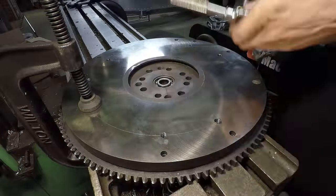All right, so now the work begins. This is a 1.25 inch thick aluminum plate here, 6061. This is what I'm going to be making the adapter plate out of. I wanted to try to find 1 1/8, 1.125, but I wasn't able to find that for a reasonable price, because I think that would have been close enough in thickness that I wouldn't have to face it down at all. This is thicker than I need, so I will have to face this down once I get my profile cut out. But that'll be fine. This is plenty of material to work with, so let's get to work.